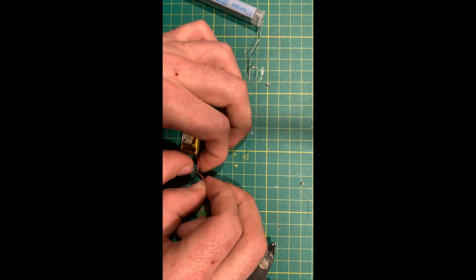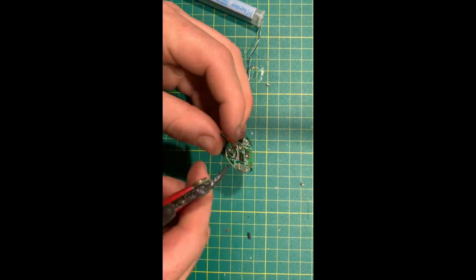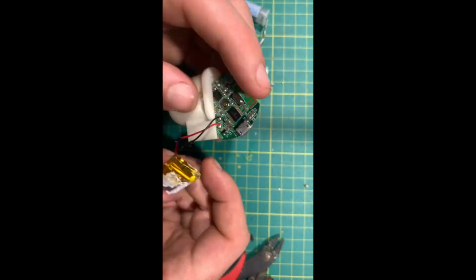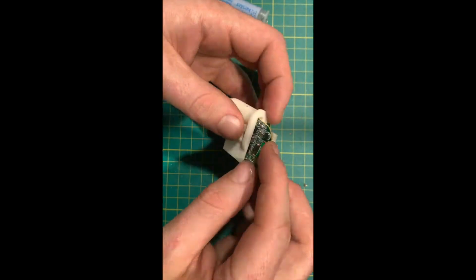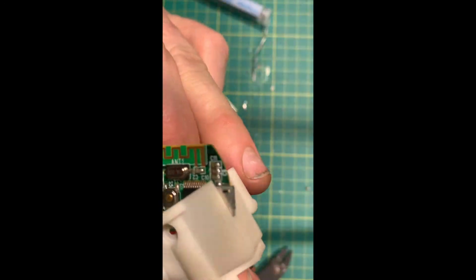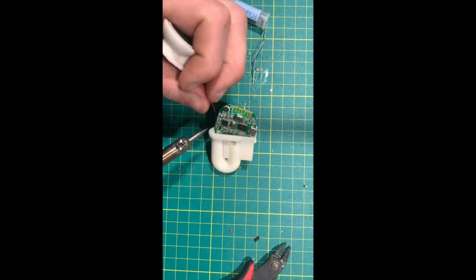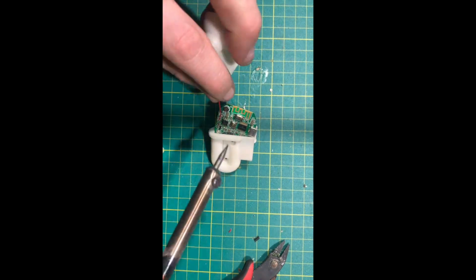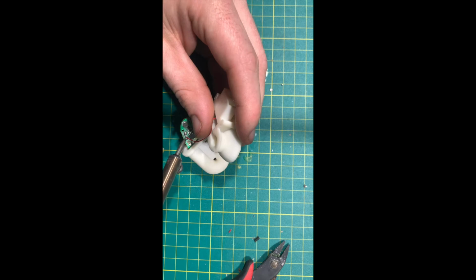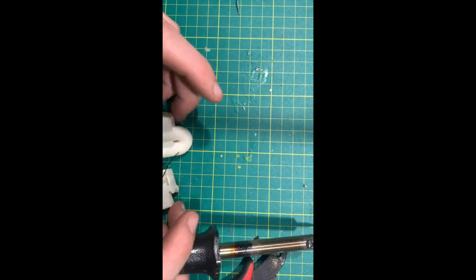Here I am using a simple electrical soldering setup to connect the battery to the Bluetooth board, which will be tucked away in the body of my final draft. I then solder the small laptop speaker that is hidden in the upper portion of my object to the Bluetooth board. Before I begin gluing all of the components together, I test to make sure the speaker is still operational.